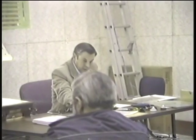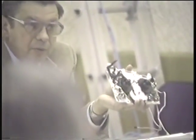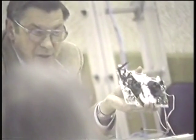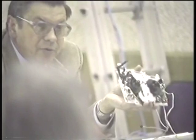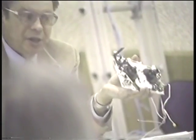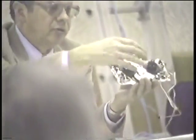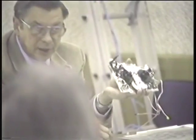Now, the trouble with using this as is, is that we want reverse capability on our machines that is almost equal to the forward capability. We want to be able to see our picture going backwards, which means that we have to control the tape tension going over the heads and the head drum and all that sort of thing. And we all know how it's done in the forward direction. We have a mechanical servo on the supply reel, which keeps the back tension correct.